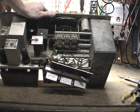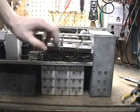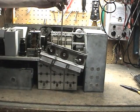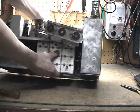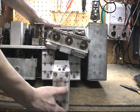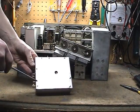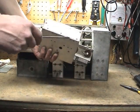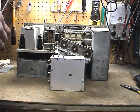So what we're going to do next is unsolder these two, drop the four screws out, and hopefully our can will come out. Okay, we have all the electrical connections off now. We have almost all the screws out — it will be our last screw here. Let's see if we can pull this out now. There we go. Our next step, now that we have it out, is to go through all the multitude of screws that hold the cover off. This will take off the bottom cover and the side. And then we'll check back in when that's done.